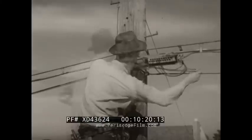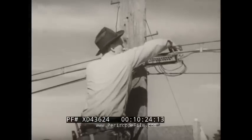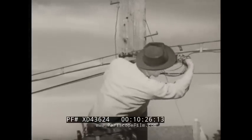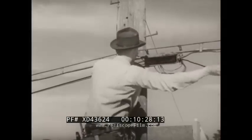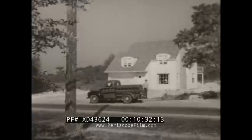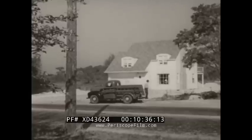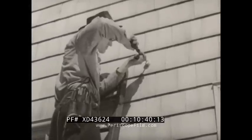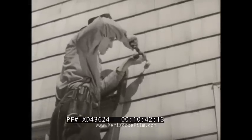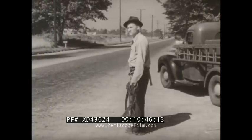While Ted is connecting the drop wire at the terminal, let's review the important steps for the proper and safe installation of a drop wire crossing a street or highway. First, a check on traffic and conditions to be sure the job can be done safely without assistance. Then, the location of the attachment on the house to provide both clearance and proper sag. Next, the preparations that will prevent delay when raising the wire.